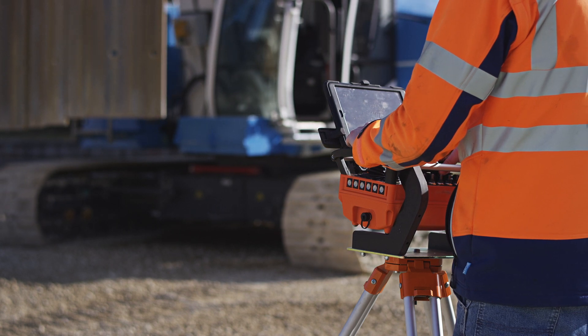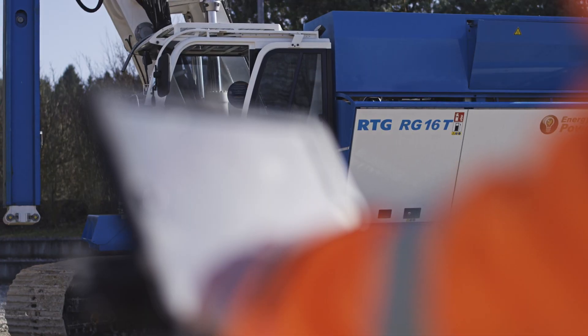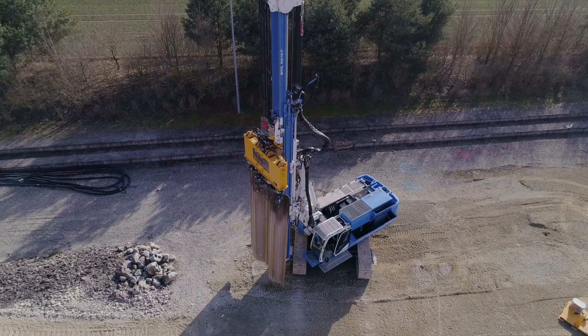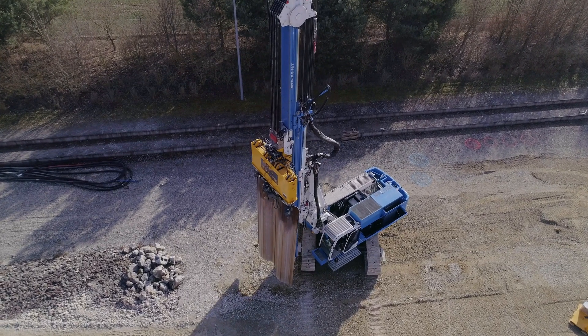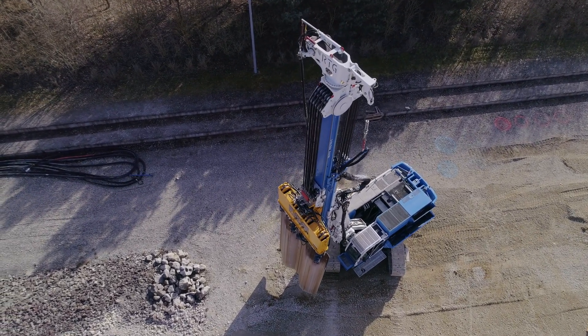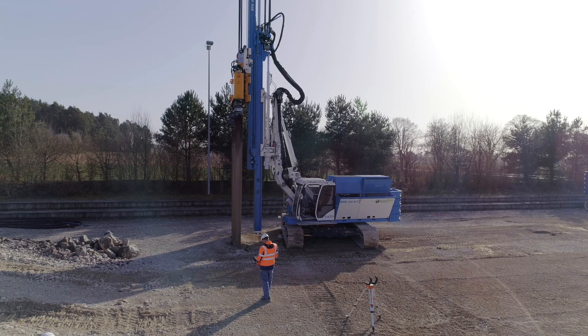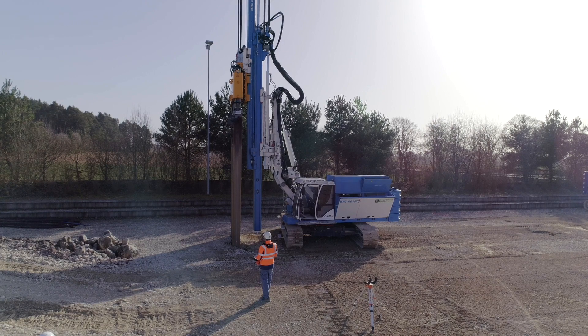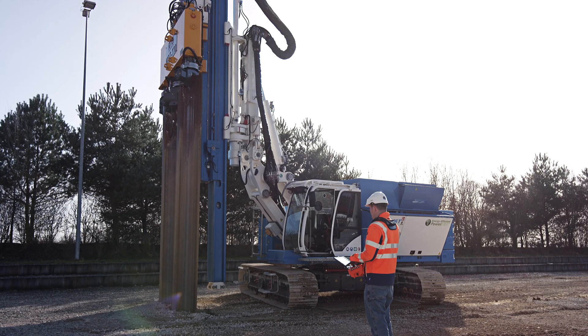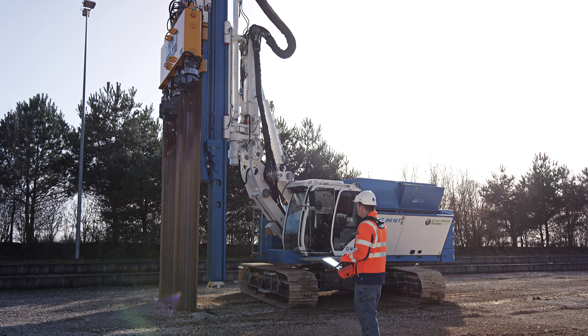This simulation shows construction of the corner element of the sheet pile box. The starting piles can be directly installed with the sheet pile press — no additional auxiliary equipment is needed. A pack of four sheet piles is positioned at one corner, and the sheet piles are pressed in as far as possible using all extrusion rams simultaneously or using the machine's feed unit.